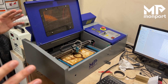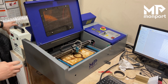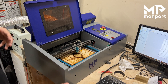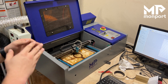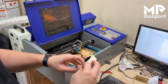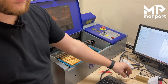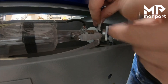I've got my laser turned a little bit differently than I normally do. I have my chiller turned on so it can keep my laser tube cool since we are going to be running the laser. We are going to have to start with the laser completely off — so just for safety, keep the laser off to begin with. You're going to take a piece of masking tape, maybe about this big, and go to the back of the laser. This is why we want the laser to be off.